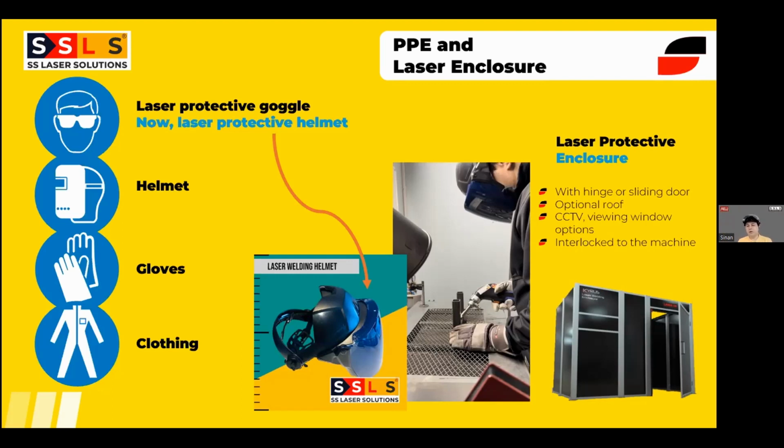You can have viewing windows, it's up to you, or you can have a CCTV camera fitted in, which I mostly prefer, because when there is CCTV you can see the view not just outside of that room, but you can also have one screen in your office. So it is much more convenient. And these enclosures are going to be interlocked with the machine. So whenever somebody opens the door, the machine is going to stop automatically. And when the laser is working inside, the laser-on light is going to be on, so everybody will know that there is a laser operation going on.